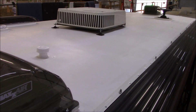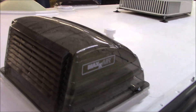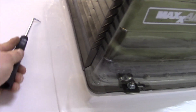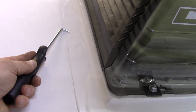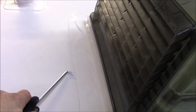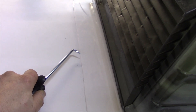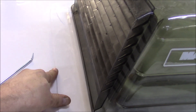We're leaving a checker tool in the kit. You slide it down the weld seams — if it slips off smoothly, that's a good weld. If it pokes in a little bit and finds a concern, take some primer, a little brush, clean out any debris up underneath, clean with acetone or nail polish remover, put the primer in, then put the caulking on. That's how easy it is. Go around everything, make sure it's nice and tight — if you see something, just clean it, prime it, and caulk it.